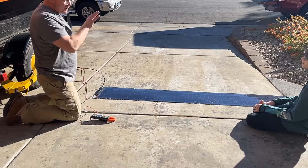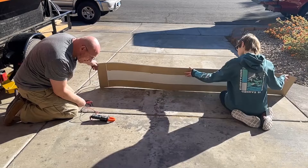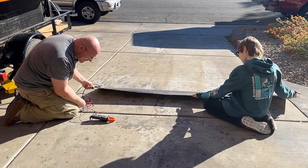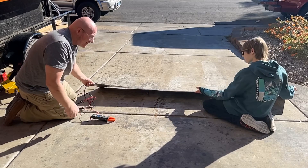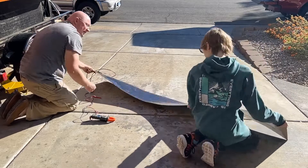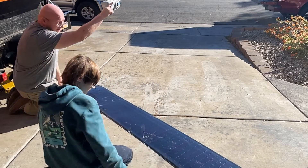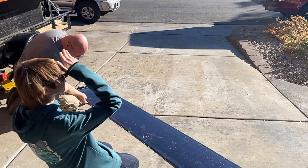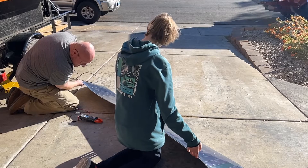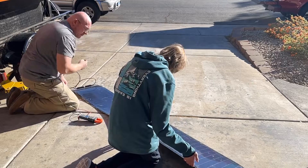We do have great sun and we are facing at a southern exposure, but we're going to tilt it up here slowly, because we know that solar panels are more efficient at an angle. We're at 3.2 — go down slowly. I'm going to try to bend it down — 3.3. So the best I could get right there was 3.3 amps. Zane, we're going to turn this a little bit and try to angle it even more toward the sun. We dropped it down flat. The sun is a little bit that direction — we're at 3.4 amps. Now slowly lift up — let's see if we can get a little bit more. 3.7, 3.6. So I'm reliably getting about the best I can get at about 3.6 amps.